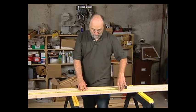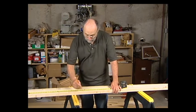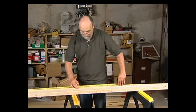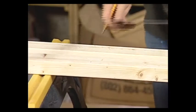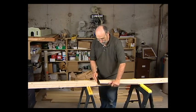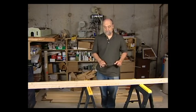These are 8-foot 2x3s, which are relatively inexpensive. You need to worry less about having these perfectly straight, though you don't want them corkscrewed either. I'll make my 4-foot mark. Even when cutting something this small or narrow, it's a good idea to go ahead and mark a square cut — it makes it a lot easier when cutting with a skill saw to have a good square line to follow. People who say they can't get good square cuts usually haven't marked them.